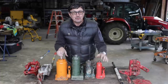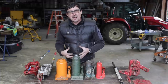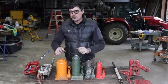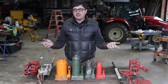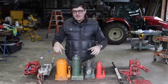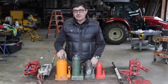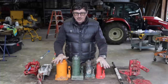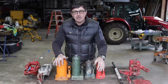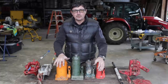The nice thing about bottle jacks is they are really strong. If you have something you need to lift that you can't lift with a floor jack, these will certainly do it. This one alone lifts 20 tons versus a floor jack's two or two-and-a-half tons - not to mention it's super portable. You can get underneath your house if you've got a sagging floor joist and lift a tremendous amount of weight. When we first bought this place I went around to all the posts in the shop - they weren't done correctly - and I jacked them all up with this hydraulic jack. They're not going to cost you anything at garage sales - a dollar, five dollars. I'd recommend having a big one and a small one, like a 10 or 20-ton and a one to three-ton.